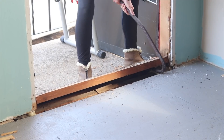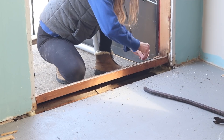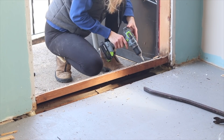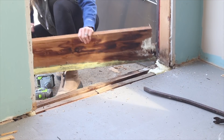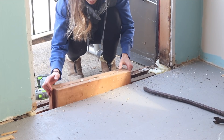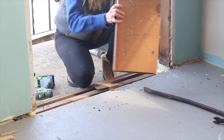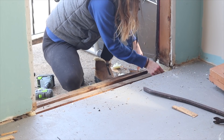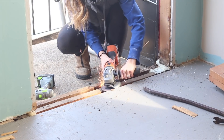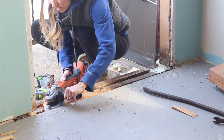So I was using a big wrecking bar and I looked down in there and realized there were some screws that I couldn't find, so I was able to clean out the head and back them out with my drill. With that removed I found some things down in the hole — there was some random wood and then a lot of that Great Stuff foam that I had to clear out so I could build new framing tight up against what was there. I also found some nails sticking up that didn't have a head on them, so I had to cut them off with my angle grinder.